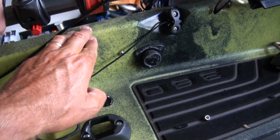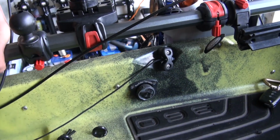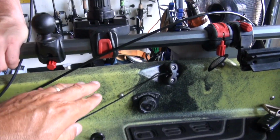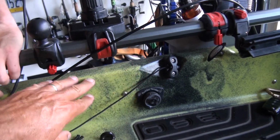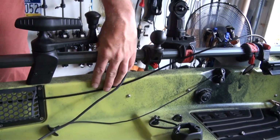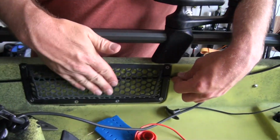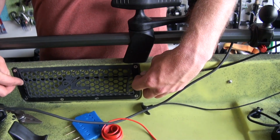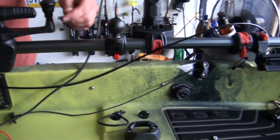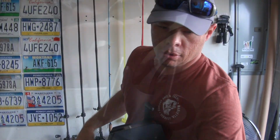When we were thinking about running it through the hull, we looked at this spot. We just had no way to really, without ripping a whole bunch of stuff out. Even when we did remove foam pieces, we didn't get our hands on that. So we're going to P-clip it. This was really tough to get to. I think this is going to work out fine, though. Like I said, I don't use this for much, but honestly, that's kind of keeping it protected as well. Yep. So, all right, let's get some P-clips on there, trim it, and then we can run the Spectra cord, and then we get this on the river.